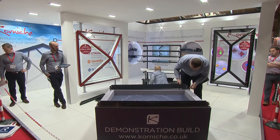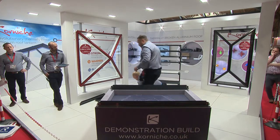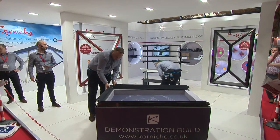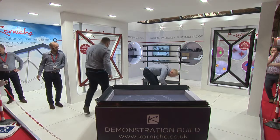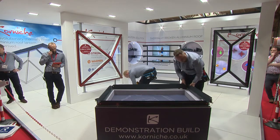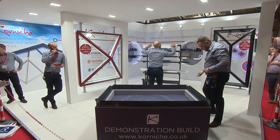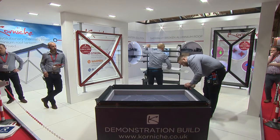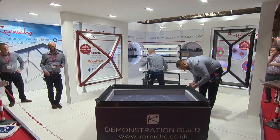So the bosses, which are pre-assembled into the ridge from the factory, he then takes the hip sections, slides them into position, and through our bolt and tapered washer system, that's all tightened up. You might just be able to see as he gets those bolts home with a screwdriver, it'll pull each section neatly into position. So once Bradley's completed that, he's going to start fitting the glazing retainers onto the glazing. And meanwhile, Sam's going to put a pair of temporary zip ties, 2 in each corner, which are going to hold all that together as they flip it over to mimic putting the sealant on.